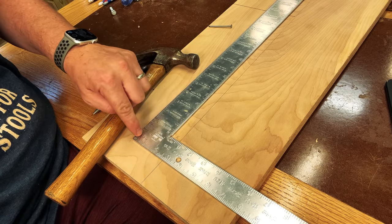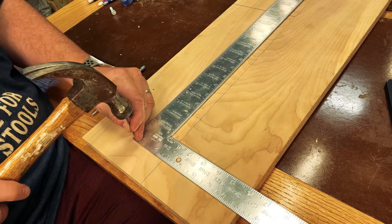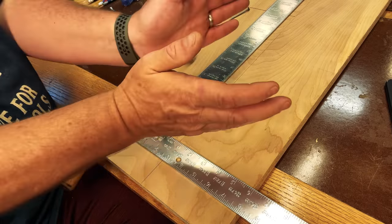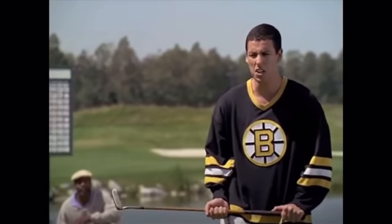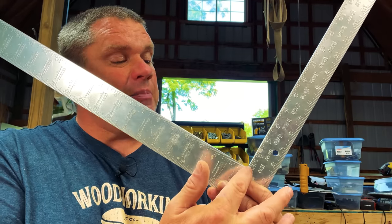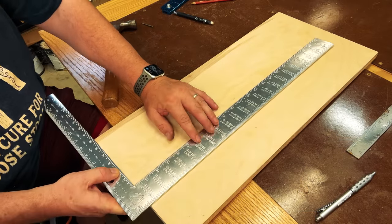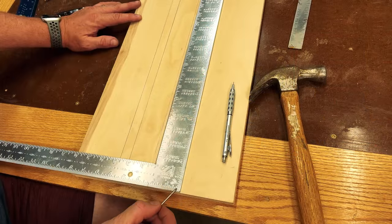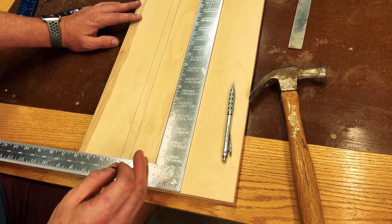To fix this problem, this hack suggests we look at the two corners of the square. If we want to move the arms together, we take a nail and hammer and lightly tap the exterior of the square. If we want to move the arms apart, we do the same on the interior corner. In my case, I want to separate the two arms just a little bit, so I'm going to tap a nail in the very interior of the square.